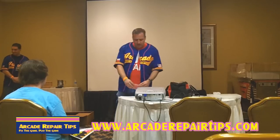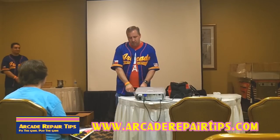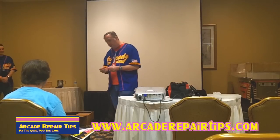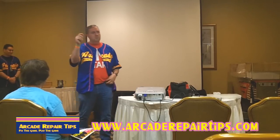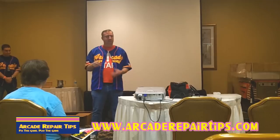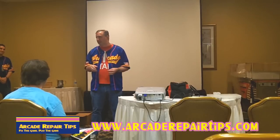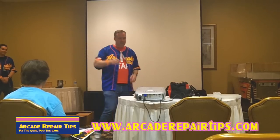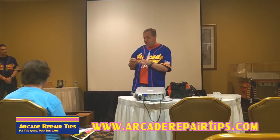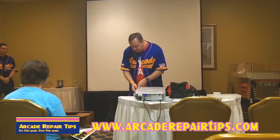This is a TV alignment tool. I don't like to stick my hand in the monitor area, especially with rings on — I have been shocked a few times. You get these from Bob Roberts. You can go in there to adjust things like the horizontal width pot. Everybody I know sticks a metal Allen wrench in there because it fits, but that's not a good idea. Buy the right tool. It has cool little extensions that make it longer, so the less brave you are, the farther back you can stand.